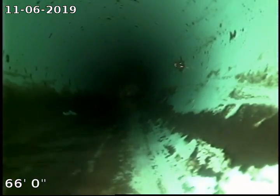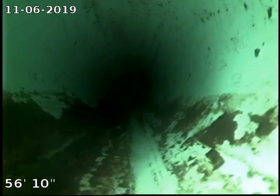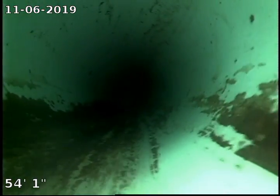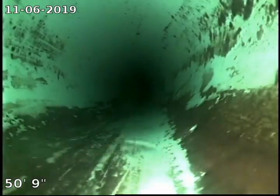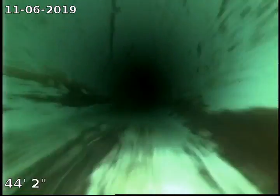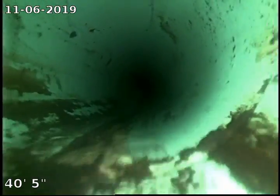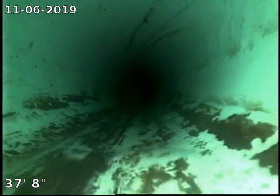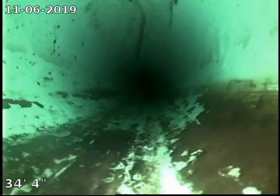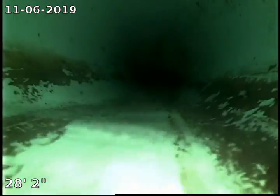So there's a little sludge buildup on the sewer line. The black stuff there, kind of in the bottom third, is just residue that's built up over time, but you can see it is soft in nature and will rinse out with flushes and volume. Honestly, more volume of water that is used at any given time will help. Those bursts of water will help clean the line and get that sludge rinsed out to the main into the city main and on to the treatment facility.